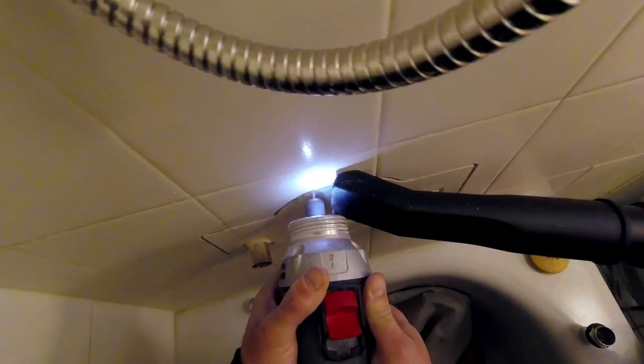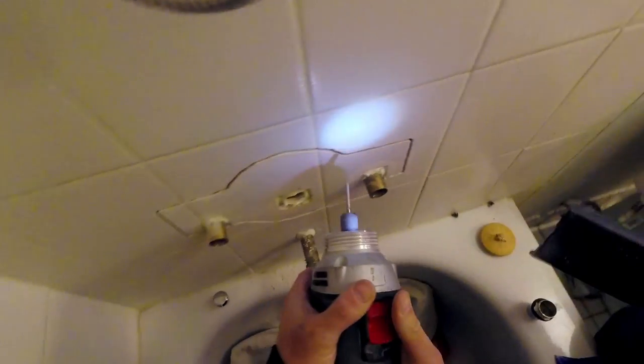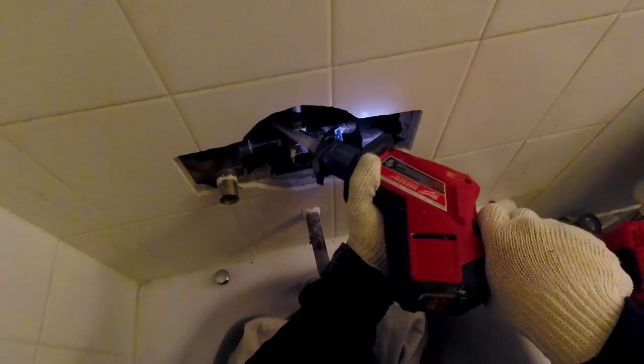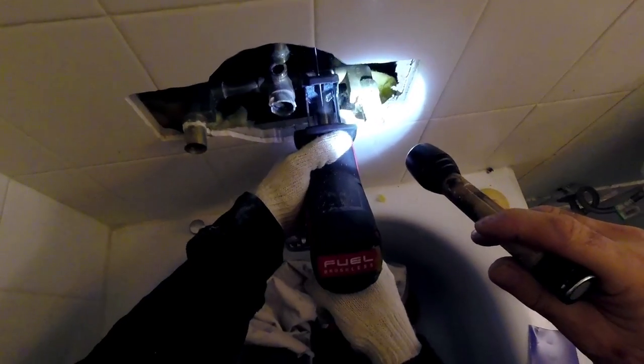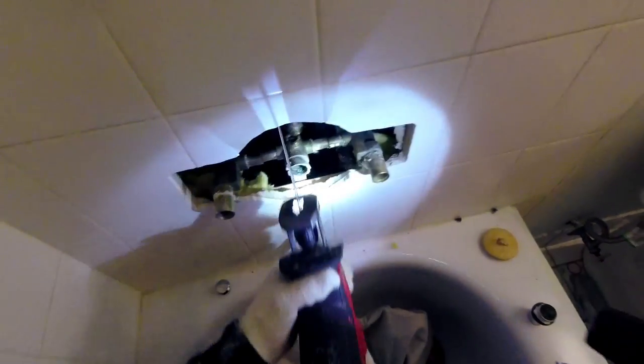This helps provide stability as you're using it, and it reduces the amount of bouncing that takes place. Secondly, I try to maintain constant tension on the material I'm working with at all times. I do this also because the most common times the tool bounces is when the tool can decide which direction it can go. In other words, you have to be sturdy between your two hands and very deliberate in the direction of your choosing. Only then will the rotozip follow your guidance calmly.